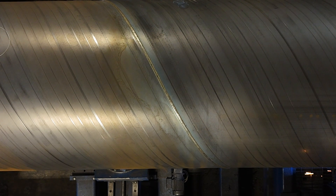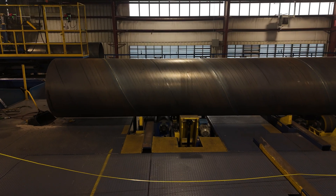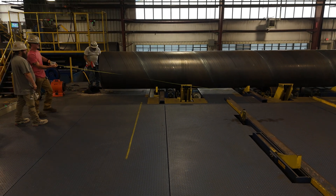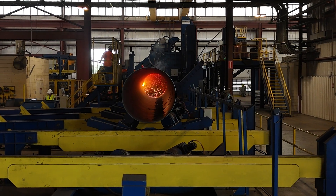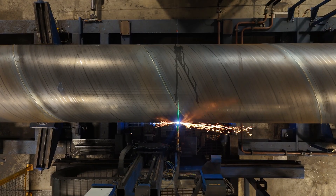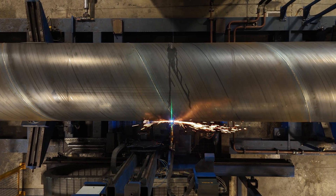The spiral pipe manufacturing process is continuous, and in theory the pipe made off the mill can be infinite length. However, we can specify a specific length and the machine can cut pipe to that specified length. We use a plasma torch set per the project requirement length of pipe, and that's going to create a cut while the pipe is actually being formed. That cutting mechanism translates with the pipe being made, so you get a nice clean circumferential cut to the desired length.